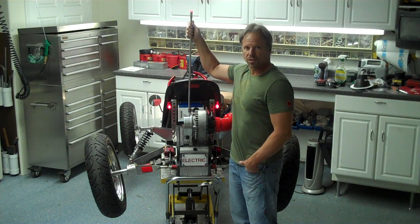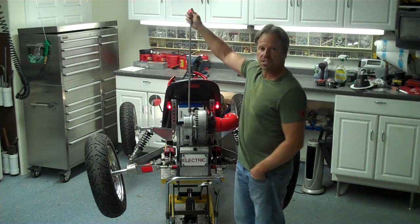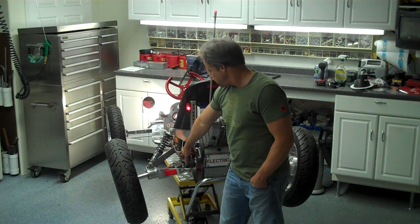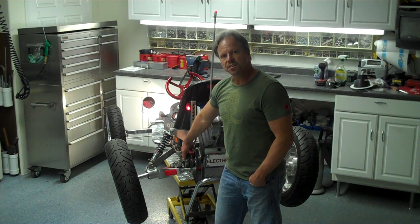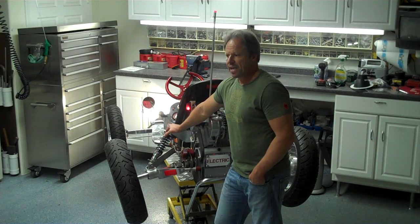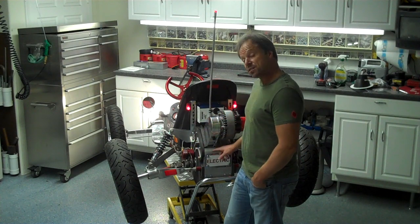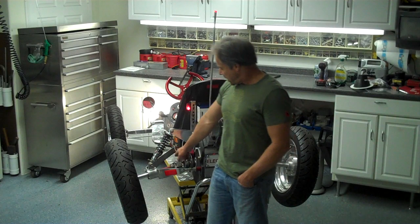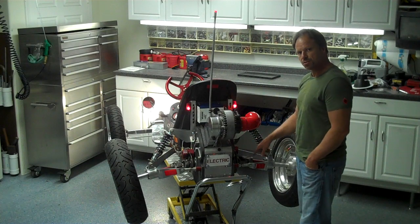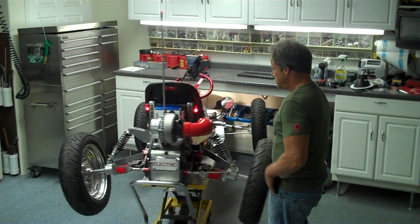This is just an antenna I put on it. I've got a red light on top just to make it more visible at night — if you're driving and there's a car behind you, they're going to see you. I do have shocks in the back. These are the brake calipers — I use racing go-kart brakes, the kind used on karts that go about a hundred miles an hour. Because I have a differential you need one caliper on each side, so I put one here and one here. It has dual disc hydraulic brakes on the back.